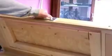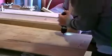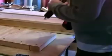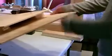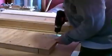Definitely go with the handle if you can — it makes it super easy to use. Then I'll connect the baseboard to this. To get the insulation in, I'm just going to remove this and this, and take out this two by three temporarily. Slide them out, jam the insulation right in, then drop the two by three back on. I just stuffed it in — took a long two by three, jammed it, filled it, jammed, filled — just keep doing it until you can't get any more in.